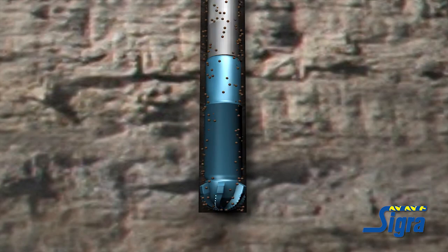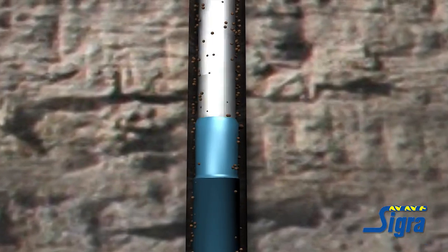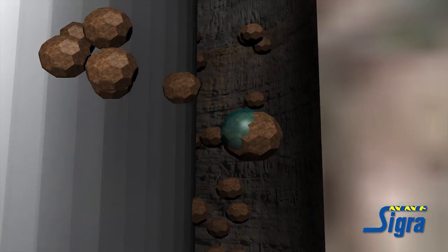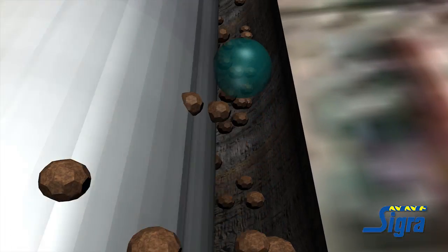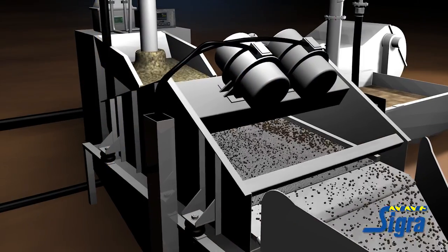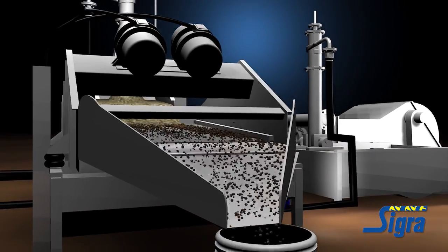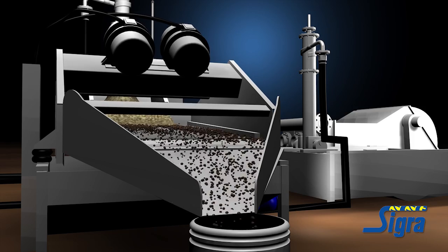For porous conventional reservoir rock, the gas is released directly from pore space as it rises up the annulus and can be directly measured. For a rock that exhibits diffusive desorption, the gas comes from cuttings rising up the annulus and in the cyclone. In addition, a small proportion is lost during transit across the shaker. This is followed by measured desorption of sampled cuttings with time, followed by crushing of a subsample to release residual gas.